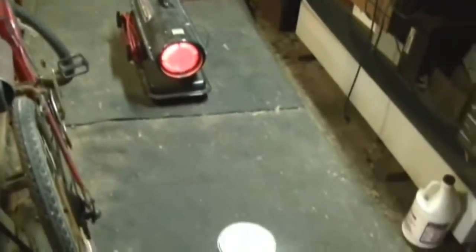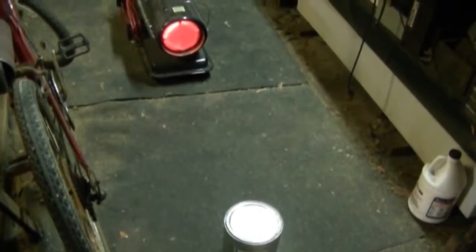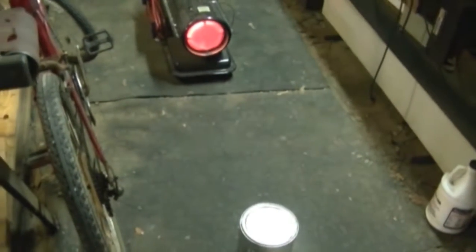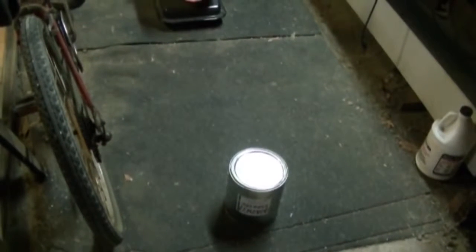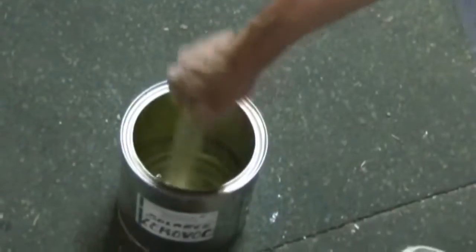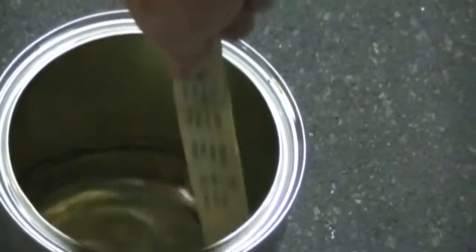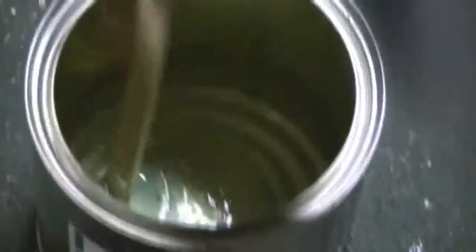What we're doing right now is the epoxy resin is real thick in viscosity — like real thick syrup. So we're using this kerosene heater blowing directly on the can, and we can get the viscosity as thin as water basically if we keep heat on it. He's stirring and checking the resin right now to see the consistency.